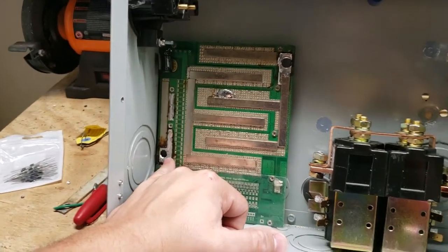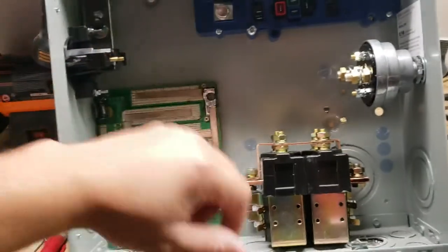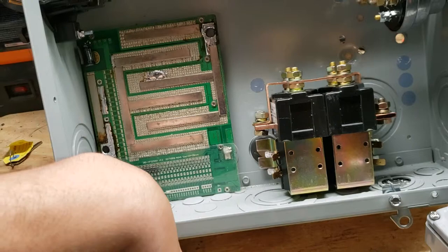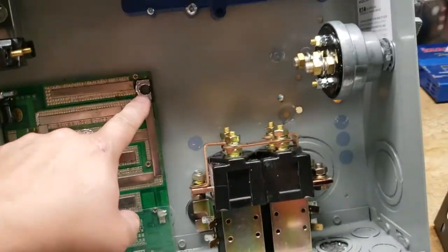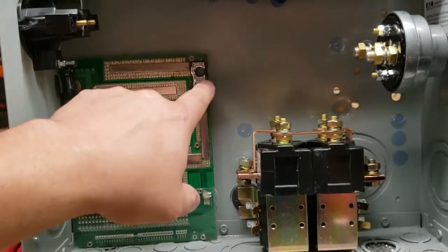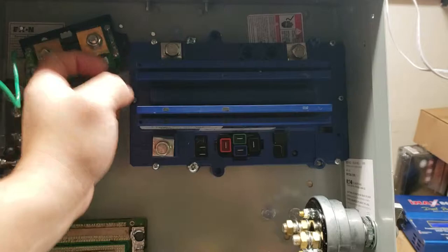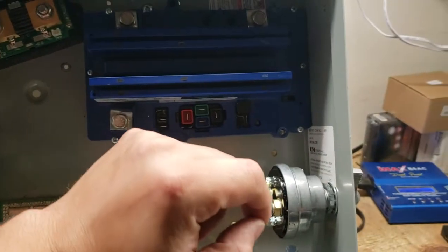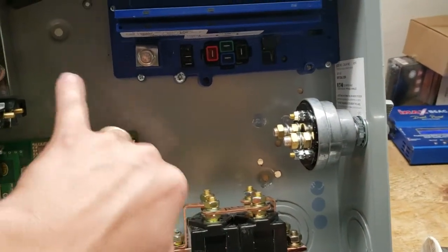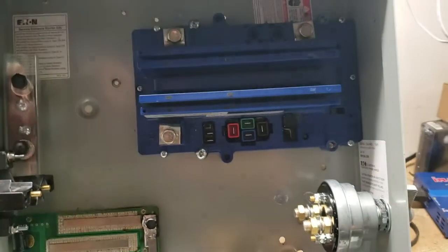My plan is to take this — the battery negative input terminal — and put a hole over here, or use one of the existing holes, and just feed ground from the chassis itself, because that's where the negative terminal for the battery will be hooked up. This is the charging and load output port, so this negative will go right up to my Altrax controller. Actually, I'm wrong — sorry — this negative coming out of the BMS unit is going to go into my fuse up here.